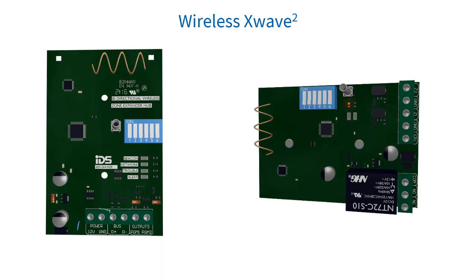The X-Wave 2 IO module is a wireless solution that has two inputs which will supersede the wired zones the module is taught to and the next consecutive zone. The output will automatically be registered and an output number assigned depending on the zone associated with it. LED1 will light up when powered up and change state when the beacon from the X-Wave 2 hub is received.